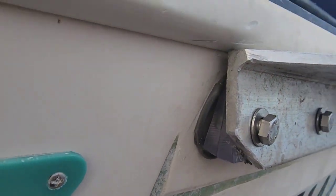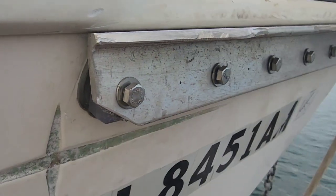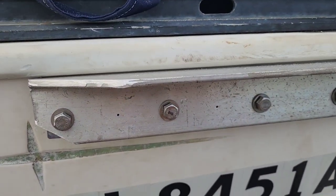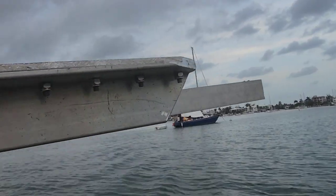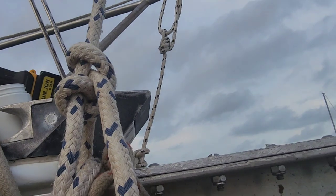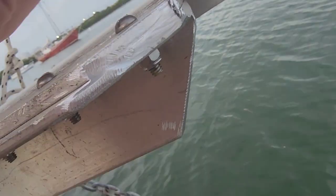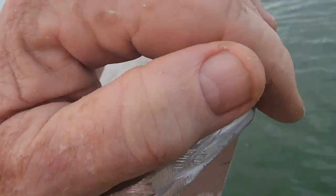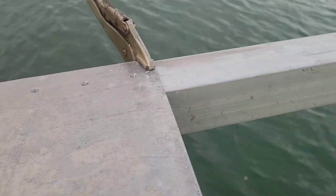You can get a good view of how I used hard plastic furniture leveling wedges to square this up with the hull so my top surface was flat. I've got the plate bolted down on the starboard side - these ropes are a little two-to-one haul system - so I've got to make some braces to go underneath here and they'll hold this in the orientation I want. I've got this side cut off and rounded off a little bit so hopefully that blunts it down and reduces any damage should I bump something. Let's go to the other side, finish bolting this one down, the holes are drilled, and make these cuts there.